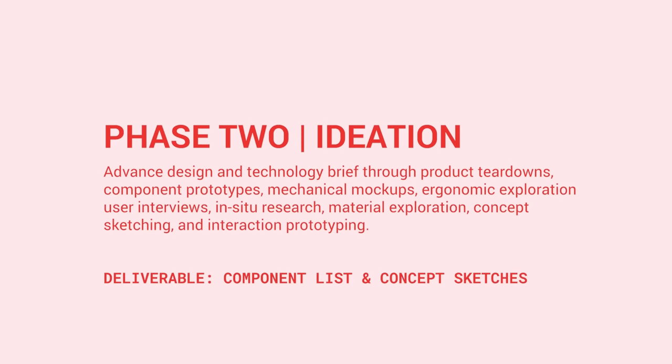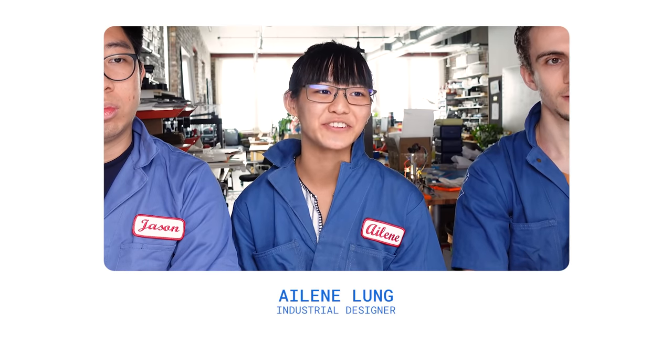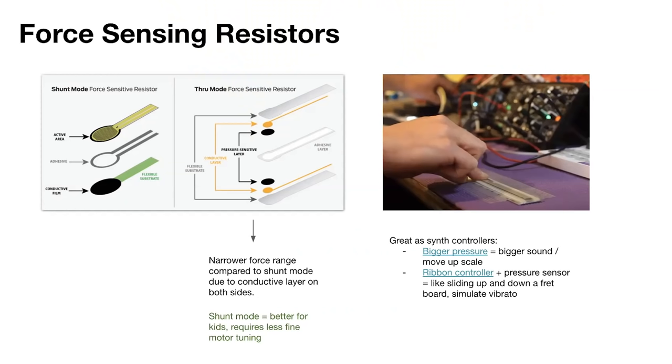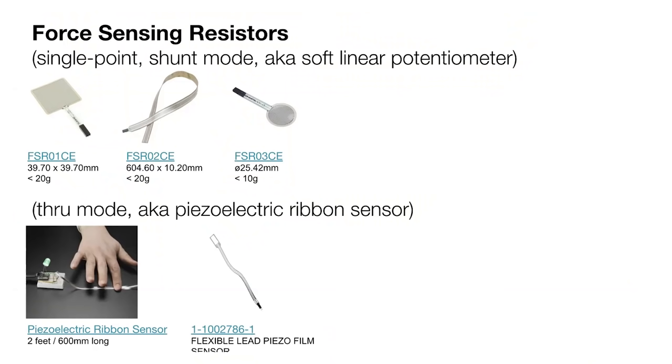Each of us went out to do some research — looking at different types of ways of making sound, ways of picking up sound electronically, ways of transforming sound. I looked into force sensing resistors, or FSRs for short, and basically they're exactly what they sound like. Depending on how hard you press them, it delivers a different signal. You can imagine that the harder the kid presses, maybe there's a bigger sound or even it could be moving up a scale. And then we have a ribbon controller and pressure sensor set up, so there are some things we can play with there.